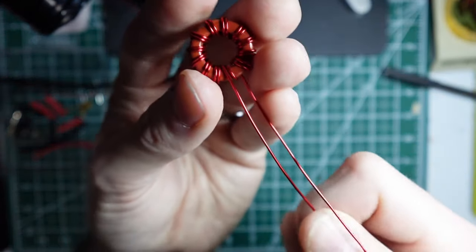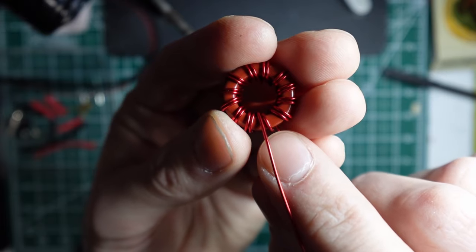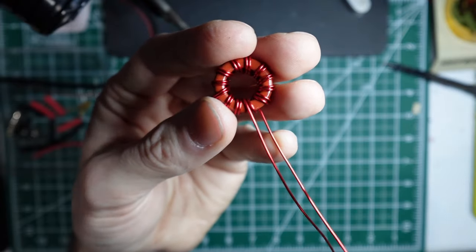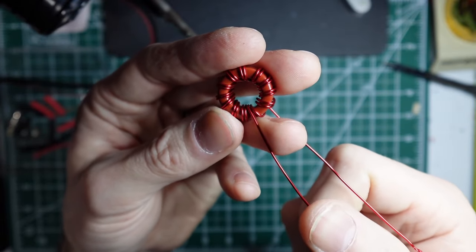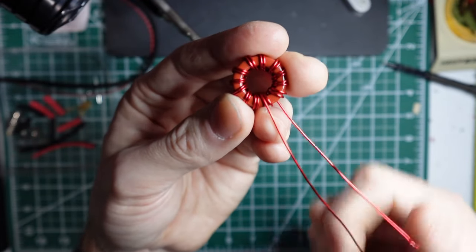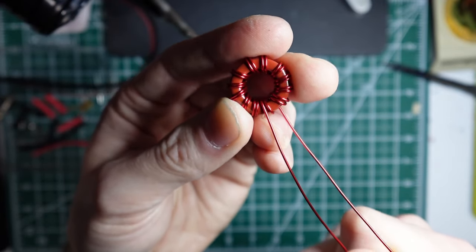This time we're going to do something a little bit different, because these pairs get soldered together if you're using three equal lengths of wire. But in this case, because we're using all one wire, we're simply winding it all together, so there's nothing trimmed there. What's different is the connection to the start of the third set of winding. We have to keep them, we could tap them, and that then goes to the center conductor of the incoming feed. So in this case, the center pin of our coax connector, which is a BNC. We can keep it just a little bit extra long, and then we'll end up soldering them together, which is the way I do it.